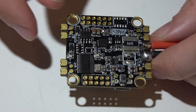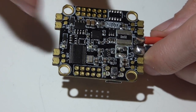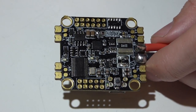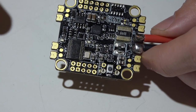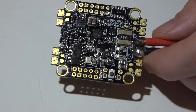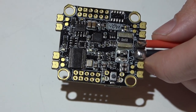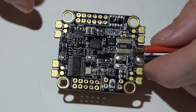With this style — the same style as the Betaflight F3 and pro versions of Omnibus — you can actually power your camera and video transmitter off the board with no ill consequences. It has the chipset for the built-in on-screen display, compatible with Betaflight's OSD feature. I can't see myself going back to a flight controller without this — I love being able to change my PIDs, rates, and expos through the OSD using the sticks on my transmitter. Combined with smart audio VTX, you can change bands, frequencies, and power output through the OSD as well. It's small, saves weight and space, and keeps me from having to take a laptop to the field.